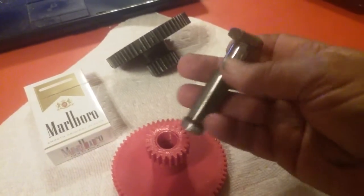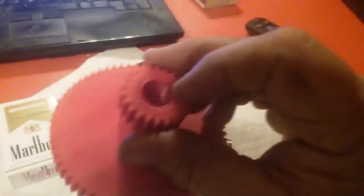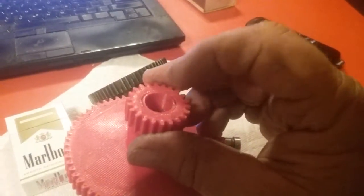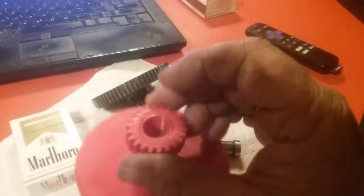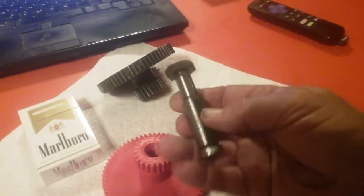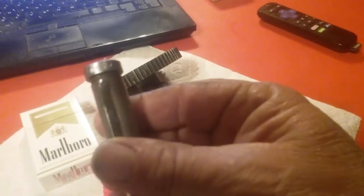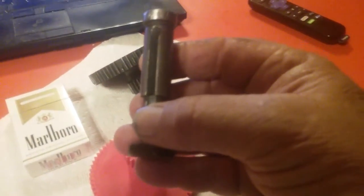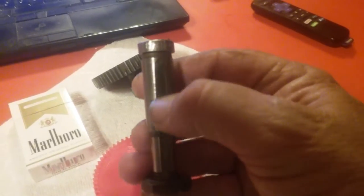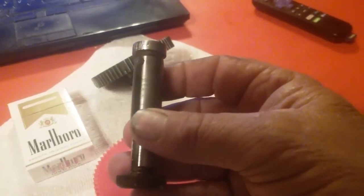This bolt and nut will go through here, but first I've ordered a brass tubing — it's very thin walled. It's going to get pressed in and probably epoxied so that it turns with the gear as a permanent fixture. Then that brass bushing is going to spin on this bolt, which has a self-oiler in it. There's a hex key that's been refilled with this weird foam-like, rock-like, silica-like stuff, so it gets filled with oil and lubricates the bushing permanently.